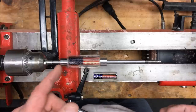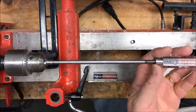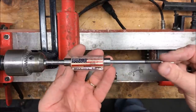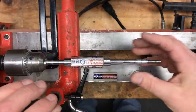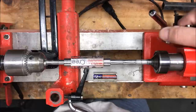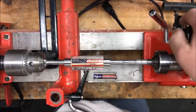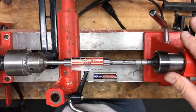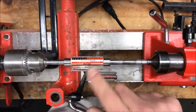What I'm going to do is remove this and put a couple of bushings on this side for spacers and a couple on the other side for spacers as well. Looks like this is going to be a one pen at a time deal, but that's okay. These are Luma light — they'll turn really well. Let me tighten up my tail stock a little bit. All right, I believe we're ready. I'm going to go ahead and put an edge on my tool and then we're going to come back and get this blank turned down.